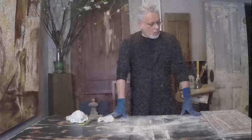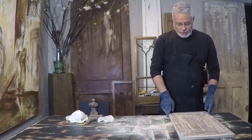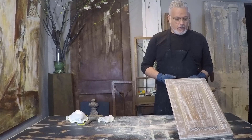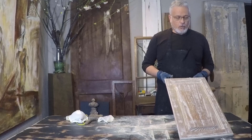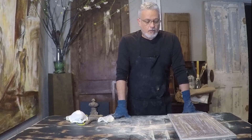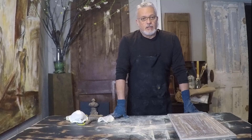Once you get the door to this point you're ready for the primer. I like to use water-based primers — they're easy to work with, no fumes, and easy to apply and clean up. Two top coats of enamel is what I recommend, and you can use water base or oil base. The oil base is a lot harder to work with. For application, I prefer to use a sprayer and you can rent one at your local rental store. The sprayer will give you a much better finish. If you decide to go with a brush you can do that, but most likely you're going to have lines that the brush leaves.